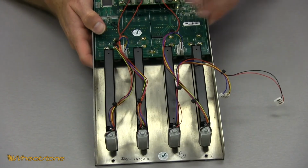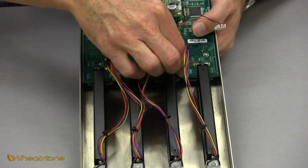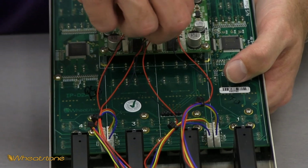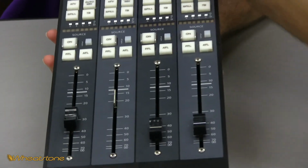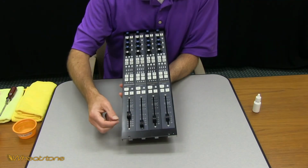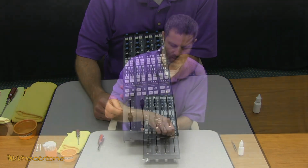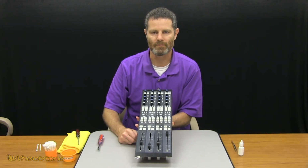Now as we go to the back, you want to make sure you reinsert your two plugs that we undid earlier. Again, try to just use the actual JST plugs so that way we don't cause any damage to any of the wires. And flip it over one last time and you reinstall the fader knob. Once you have it reinstalled, you can slide it up and down a couple times, make sure it's not binding, dragging anywhere, and for proper operation. And now you have a cleaned and lubricated Penny and Giles 3000 series fader. Thank you for watching.